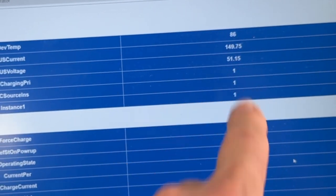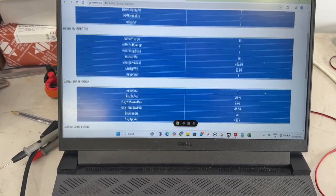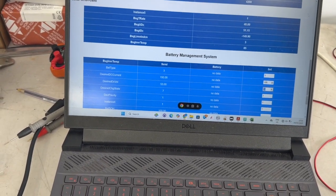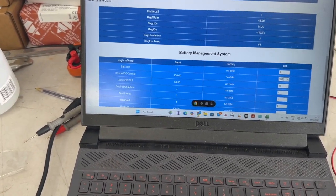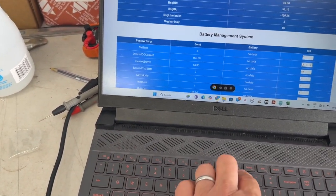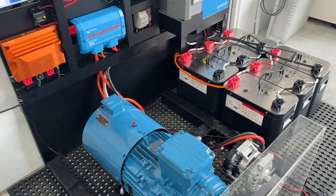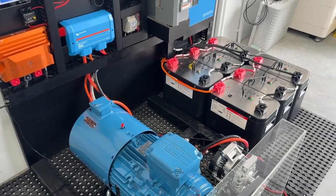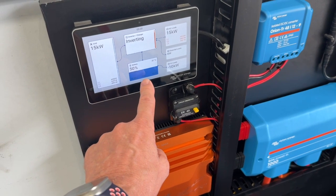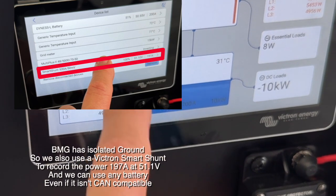You can see the device temperature at the moment is 86. We're running 149 amps and we're about to have a bit of fun here, so you can watch it live. I'm going to set the parameters now to go to 200 amps, which is 10 kilowatts, and let's see if we blow it up. We haven't rehearsed this. We're doing 10 kilowatts of charge going in there — 200 amps at 50 volts — so we're putting 10 kilowatts into the battery.